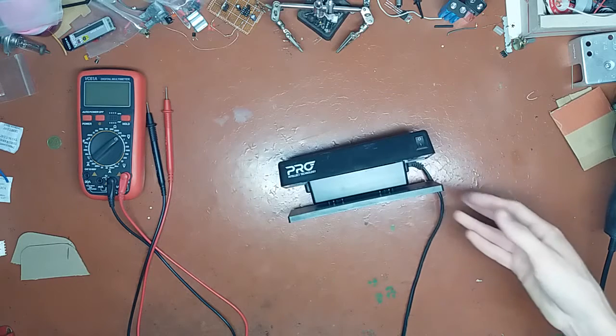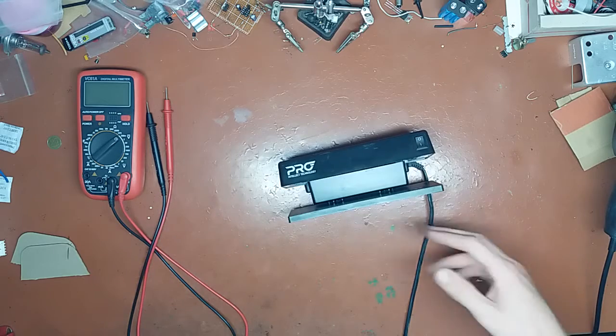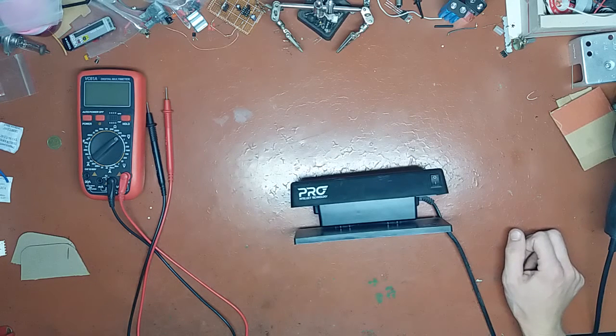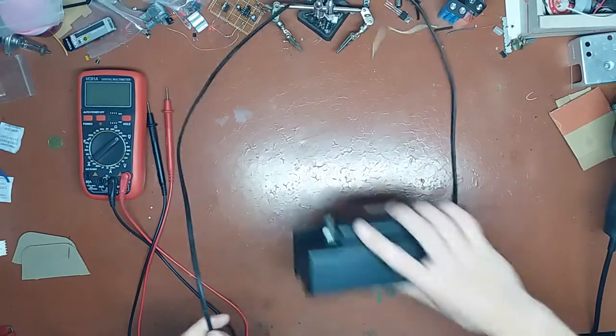Basically what this is, it is a source of UV light, soft band UV light, not a quartz lamp kind of UV light that will kill you. That thing nukes the place, kills the bacteria in the vicinity. This is a whole other story. It has a small little BLB blacklight bulb that is just a fluorescent tube that emits soft band UV light, which is used to check if the money is genuine or not. Because on the money there are some coatings which fluoresce, which emit visible light when you put UV on them. So how do I test it without even taking it apart?